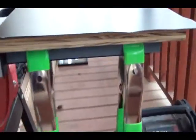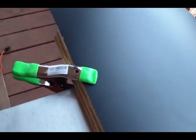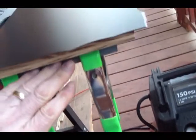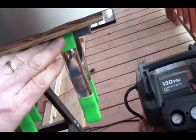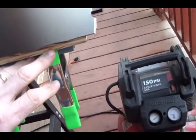And we clamped this piece down with 2 clamps right here onto one of the cleats that's on the speaker panel against the bottom edge of the table saw, and have another clamp over there, and all this is away from the working edge where we're going to be going around. This is down low enough and back far enough that the bit is never going to come in contact with any of that. It's going to be riding right here, and this is back about 1/2 inch clamped in. Nothing will touch because it won't even go over the edge of the plywood.